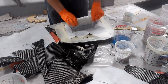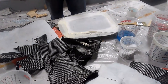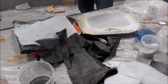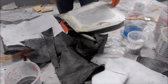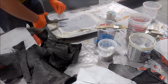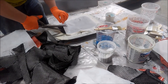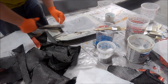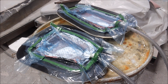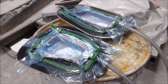You can see Devon laying up one of the internal ribs. You've got a back set, a middle set, and a front set. The middle set are kind of rectangular with a little bit of slope on them. Here Devon is putting down the peel ply, and here they are under a vacuum bag — those two are done with no problems.